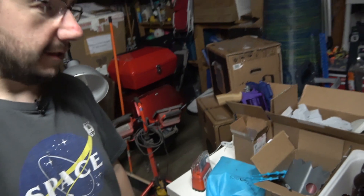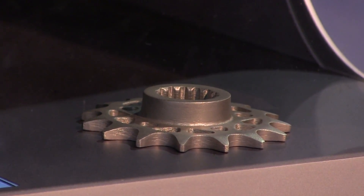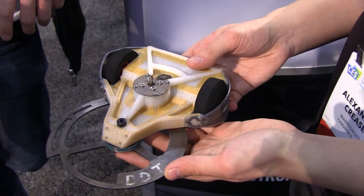Here we are in my garage — and yes, those are beer bottles — but one of the things you should know is that everything that I print is plastic. I know I can have some metal-infused prints with Proto-Pasta metallics and ColorFabb infused filaments, but everything is still plastic. Markforged has changed that with their Markforged Metal X, and it can print with a metallic powder that is then sintered and you have a metal piece right from a desktop printer. The Metal X printer from Markforged brings the ability to print with metal to the desktop market. It uses a process called ADAM — Atomic Diffusion Additive Manufacturing — and it can scan the part as it prints, ensuring you get the exact dimensional accuracy you need for the part on the bed.